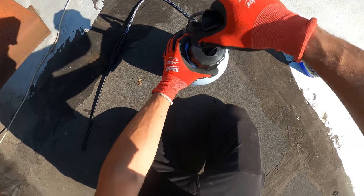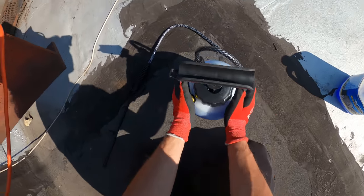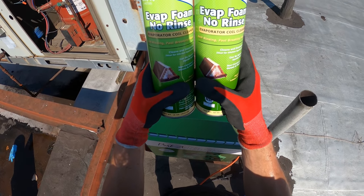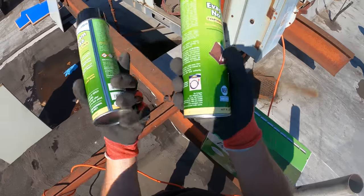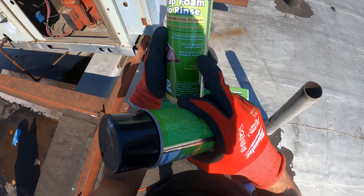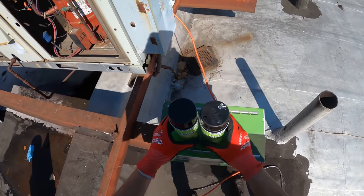I pressurized the tank — pumped it up, and there's already a lot of pressure in there. We're going to use this for the condenser. I'm also going to do the evaporator coil a bit of justice: this is an evaporator coil cleaner that foams and apparently you don't need to rinse it, but I like to rinse it anyway. This one deodorizes, has a nice pleasant smell, and it's non-corrosive. You don't want to use condenser coil cleaner on the evaporator — it's going to eat it right up.